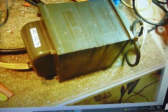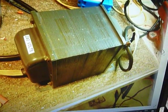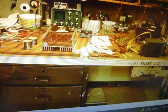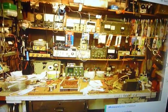That's a 240-volt converter transformer — I was running on 120 volts to check circuits out. There you can see the quarter-inch thick mounting plates, or heat spreaders — those were from some other commercial transmitter I bought just to get that part. There's the heat sink down below, and this is the workbench where I put everything together.